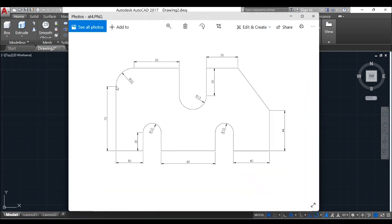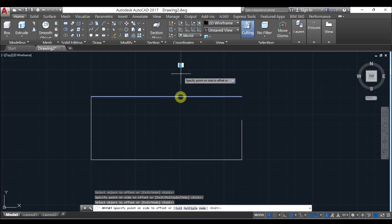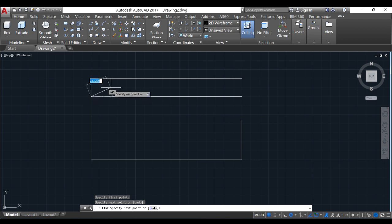From this point now, we have a fillet of 20mm radius. What does that mean? Because from this place up is 20mm, and from this place to the left-hand side is 20mm — that is 20, 20. From here to the center of this place is 20mm. Therefore, we are going to draw a line to form a box. For ease, we will simply offset this baseline by 70 and by 20 up.